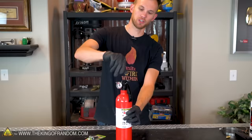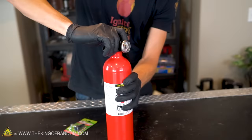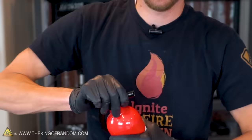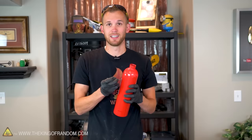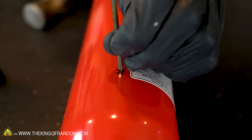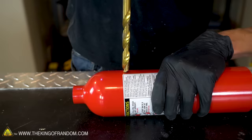With the tank cleaned out, it's time to attach the tire valve. First, I'm going to screw this back on as tightly as I can to figure out which direction it's going to point when I'm using it. I want to add my tire valve on the opposite side of where it's pointing. Since this is a round metal container, it's going to be pretty hard to drill right into the side, so I'm going to use a nail to give an indentation that will help guide the drill bit. We need a drill bit slightly smaller than the widest portion of the rubber on the valve — I'm using a 1/2 inch drill bit.